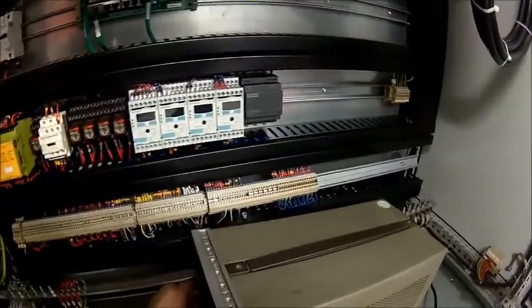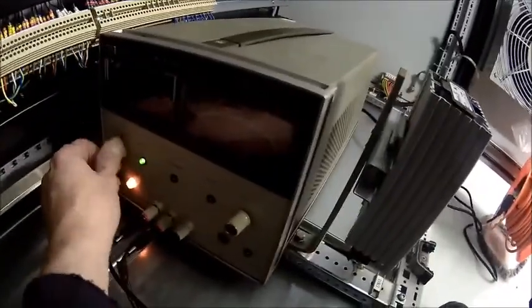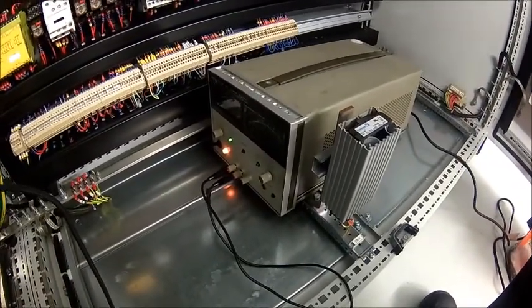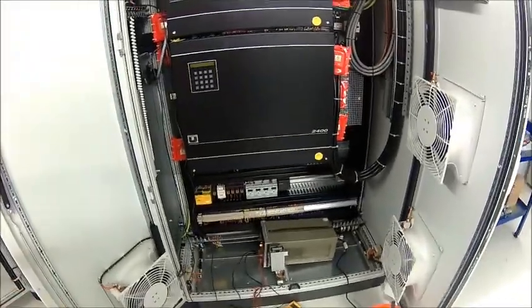We've stuck a screwdriver here and here and connected the wires. We're only going up to 50 volts so it's not dangerous. We crank everything down and then power it up to see what happens. It's hard to see but it's not drawing any current — that's full. Let's check if there is any leakage current. Looks good. There is almost no leakage, and that little bit of leakage comes from the drain resistors, so that's fine. I'll leave that sitting for about 10 to 15 minutes.